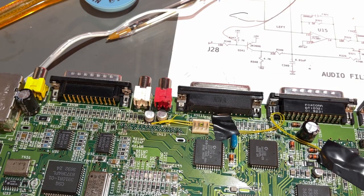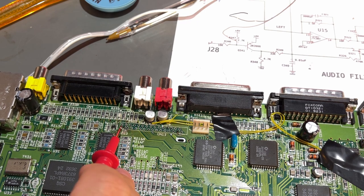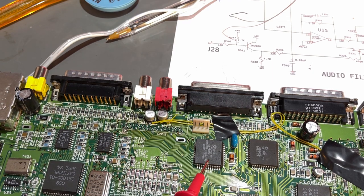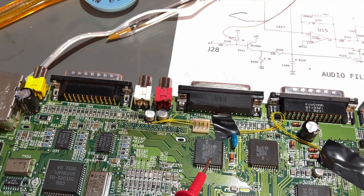The never-ending nightmare continues, and now with this connector, and three of these pins here are not connected anymore. Two of those were ripped off, and then the third one I actually cut when I tried to file the traces. Traces are so thin. These three run directly to this chip, so I'm gonna fix that with some more bodge wires then.